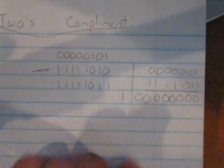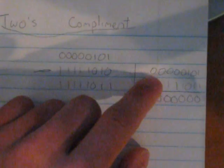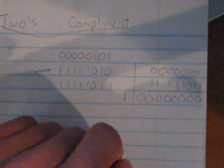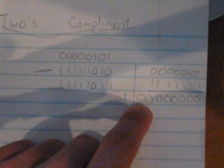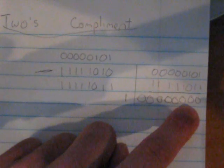If you add a larger number — say you add 10 to the 2's complement of 5 — you actually get 10 minus 5. Because it's like you're taking 5 plus the 2's complement of 5, which equals 0, but instead you're taking a number 5 higher. So instead of 0 for your result, you get 5, and 10 minus 5 is 5, so that makes sense.